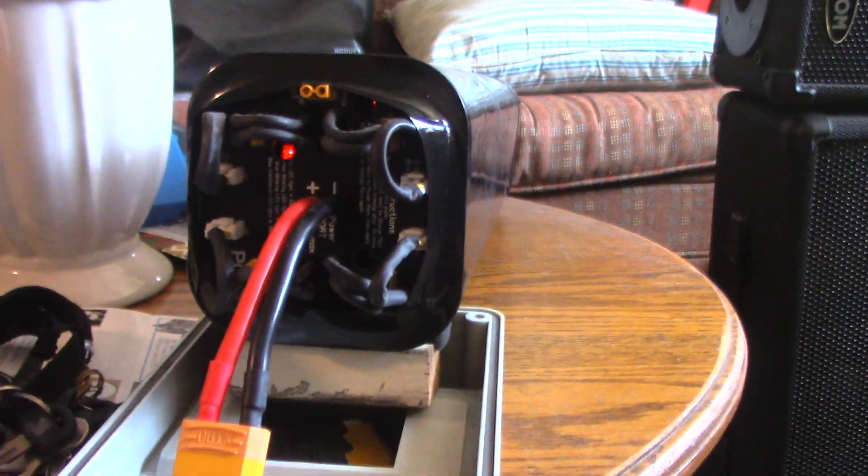I'm running off of the Valence 12-volt battery — the bigger one, not the smaller one. Victron 130 does a pretty good job, but I think it goes into absorption way too quick. I'm not sure why that happens — I know the battery is nowhere near full, but it could be the BMS playing games with it. You never know what the BMS is going to do.